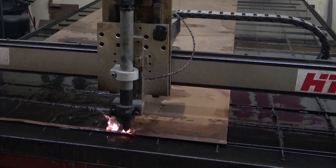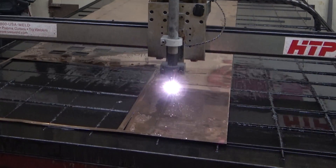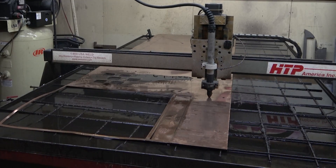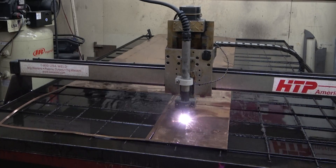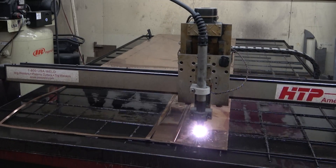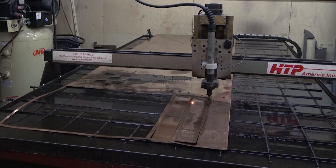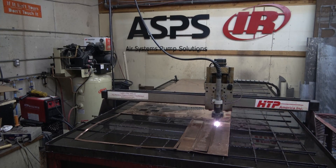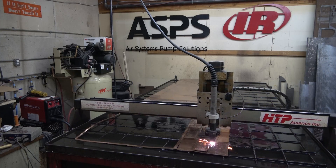As far as the actual build, the metal we're using here is 24-ounce copper — that means a square foot of the sheet weighs 24 ounces. In my area they only come in three-foot by ten-foot pieces. As I laid this pit out, that basically meant I had two shots at it with absolutely no room for error — just a couple square inches of extra space on the sheet. At almost $400 a sheet, I really did not want to mess this up.